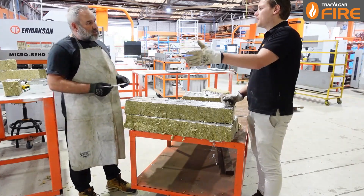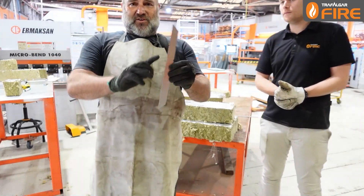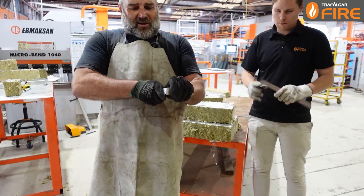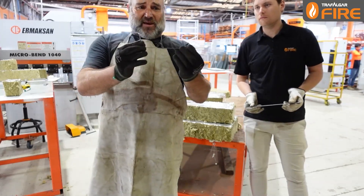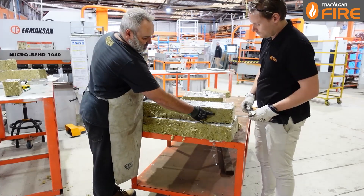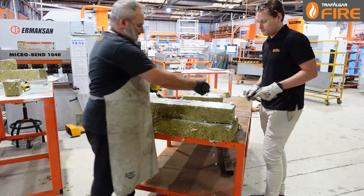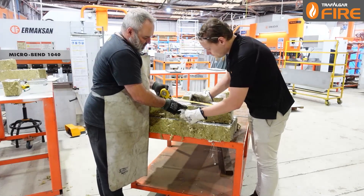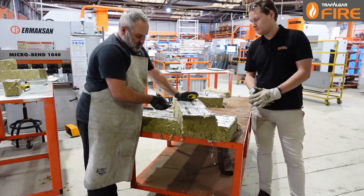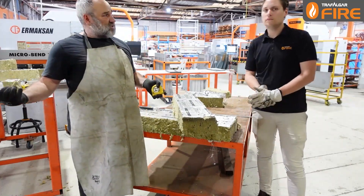Now how are we going to put these brackets in — do we put them on the slab first? The smartest way — and if you come in a bit closer to the camera, you'll see there are notches in these brackets. This notch is 110mm wide, so I can fold it on the notch and fold it up again if I choose to go on the slab edge. It's got a little rounded point, and all we need to do is come in 300mm from the mid-height of the CWFS, push it in nice and easy, then turn it sidewards and dynabolt it to the slab.